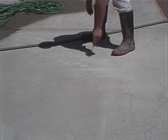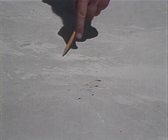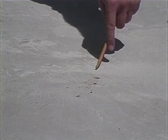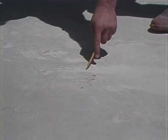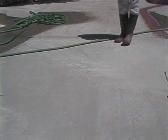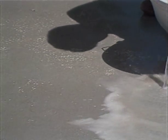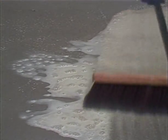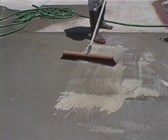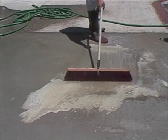As part of the cleaning process, all decks — including decks just poured the day before — must be acid washed. Always acid wash immediately prior to the topping application so the surface does not get contaminated. Use one part muriatic acid to one part water for older decks, and one part acid to four parts water for new decks. Never put acid on dry concrete; always wet the surface first. Scrub acid onto the surface with a brush, and be sure to scrub all surfaces including the cantilever edge.